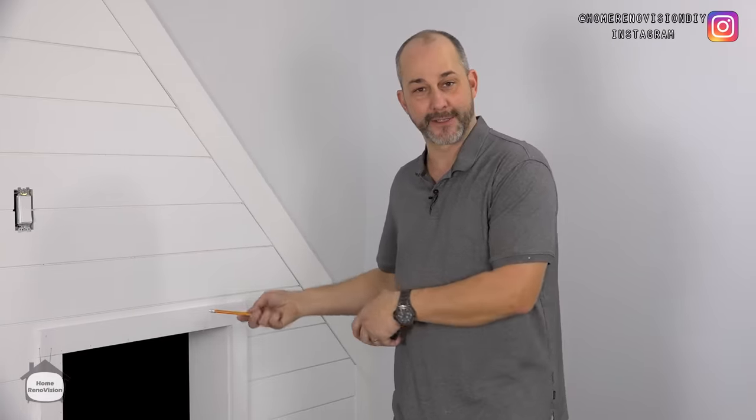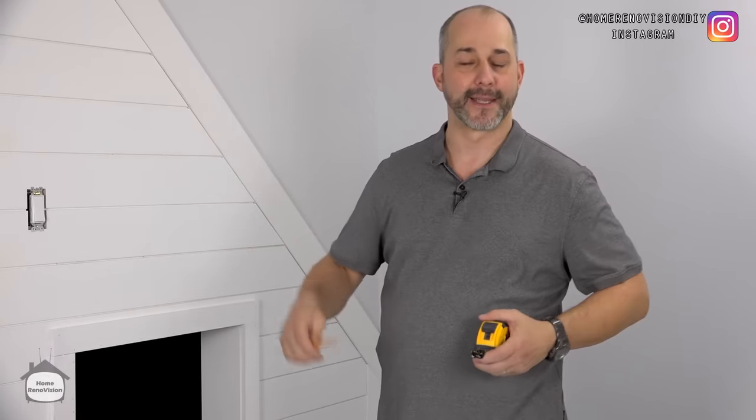Like a lot of homeowners, you've got old doors or a damaged door and you need to replace it. If you go to the store to buy a new door it'll be 80 inches tall in most cases, and if your hole is smaller than that you're going to have to learn how to cut it down. Whether you're adding multiple layers of flooring or adding a smaller door to access under the stairs, it's a really simple process to cut down the door to get the exact height you want.